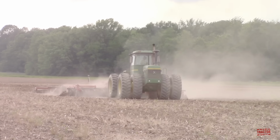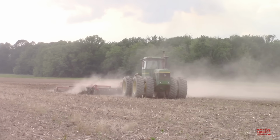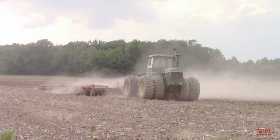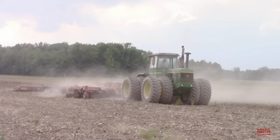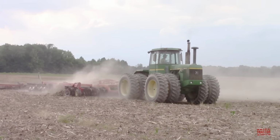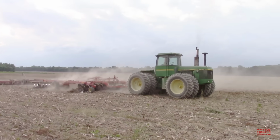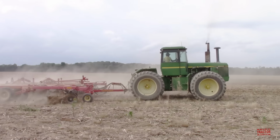The tractor features a John Deere quad range partial power shift transmission with 16 forward and 6 reverse speeds. It's equipped with a 214-gallon diesel fuel tank and weighed in from the factory at 22,470 pounds and can be field weighted up to 26,270 pounds. The original price tag for a John Deere 8640 when it was new was $77,628. Customers could order an optional 1,000 RPM PTO for $2,040, a 3-point hitch for $4,688, and a differential lock for $600.